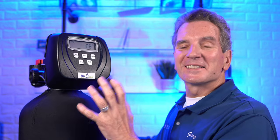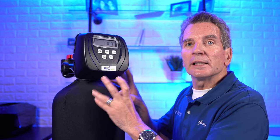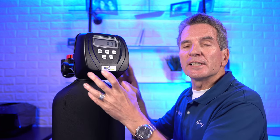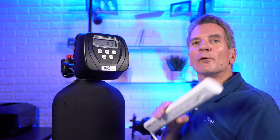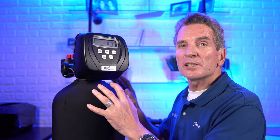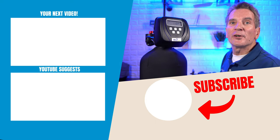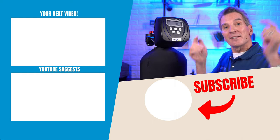Once you've made those few changes, you now have a fully metered, state-of-the-art water softener valve converted from your older time clock valve — and it's amazing how easy it is. A couple of things to keep in mind: once you've initially powered up the circuit board, it needs to be plugged in for at least 24 hours for the power cell backup to turn on and retain all your settings. Also, you've spent money on that circuit board — make sure it lasts. Get a surge suppressor, especially if you're in a cottage or cabin where voltage fluctuations can occur. Click up here for my next video on water softeners, and add any questions or comments down below.